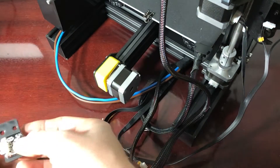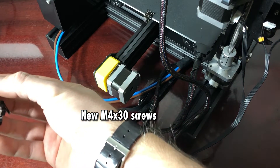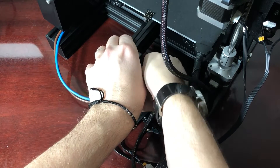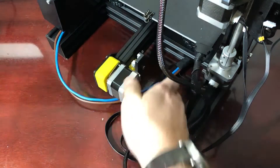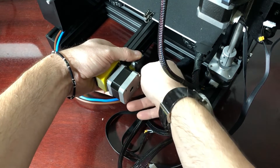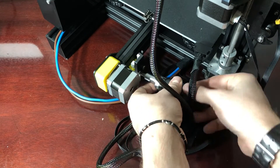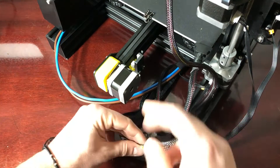Then we move to the back and we will need two new M4x30 screws. Put in the spacer that comes with the Thingiverse file — link and credits in the description. Put it back in its place. It is also useful to put in the cables before tightening everything up, as it becomes a bit tricky to fit back the connectors of the motor and the switch afterwards.